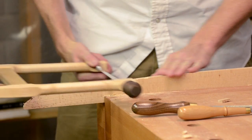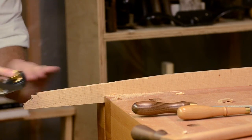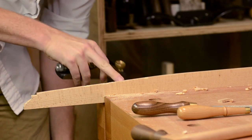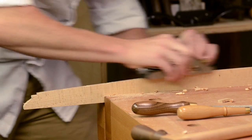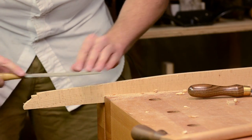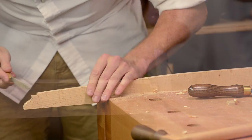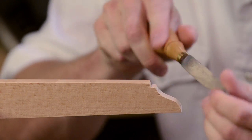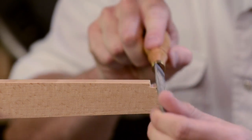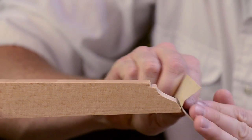After I finished cutting with the bow saw, I take a very sharp block plane and knock this down. Keeping the pencil marks in sight so I don't go over the line, but just come right up to it. This is a modeler's rasp — it's perfect for getting these little details. I used to think why would you spend money on a rasp, but I've realized that a nice rasp is worth its value. I'll put a link for this below the video. Just take that down until it's nice and smooth all over, and then you can sand it down.